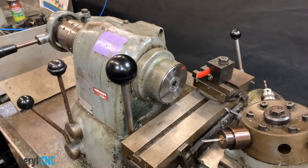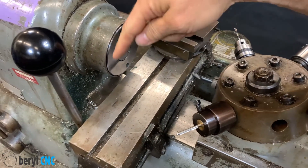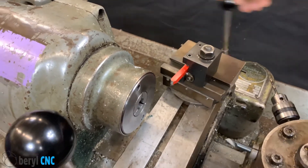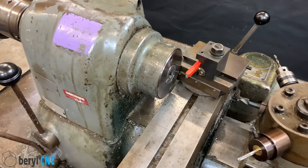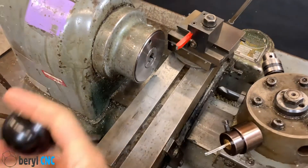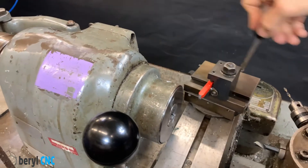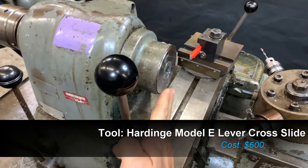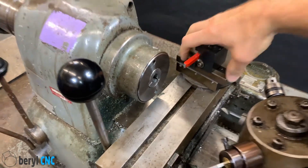There just wasn't a good solution for how exactly to get a profile on a part. If you have a part and you want to get that shape around the profile, what do you do? Here's basically a taper slide tool — you spend a half hour tooling this up and then you can put a little taper on your part. That's great, but what if I want to do a sphere or a crazy bunch of steps? Something that's not as simple as just what you can put on this part here, or as far as parting off — you can put a parting tool here and part off your part when you're done. But it would be really nice if this area of the machine could do all of that stuff.